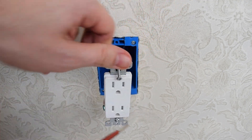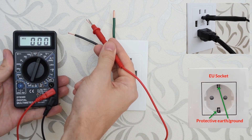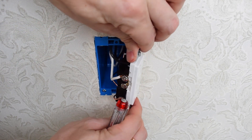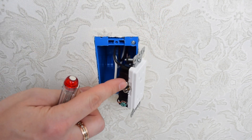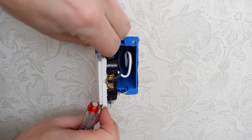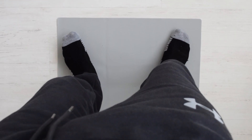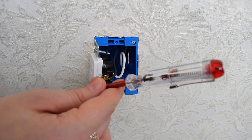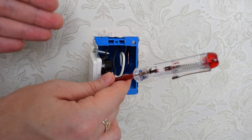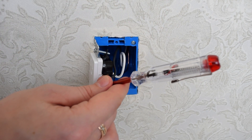You can easily check your outlet's wiring with a voltage probe or regular multimeter. I have a video which explains how to identify hot, neutral, and ground wires using a digital multimeter. So if you didn't manage to turn off the power, it's absolutely safe to touch the neutral and ground wires, but you must be extremely careful with the hot wire. You can safely touch it with your bare hands only if you wear rubber-soled shoes or stand on a rubber mat, and you don't touch the neutral and ground wires or any grounded device. So if you touch your wall, floor, water pipe, fridge, or one of these wires while holding the hot wire, you can check out earlier than you planned.